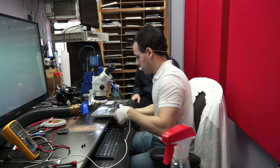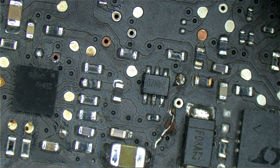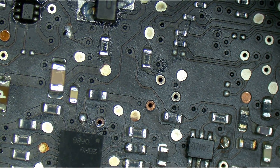First things first: Thunderbolt was shorting a bunch of things on the PP bus G3 hot to ground. Over here we have a lot of stuff replaced around the Thunderbolt area, a few jumpers run, and also some touch-up of the feedback trace. We went over touching up the corroded vias and corroded probe points, like these ones here.